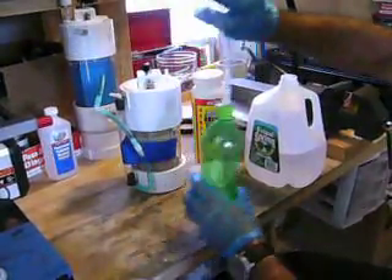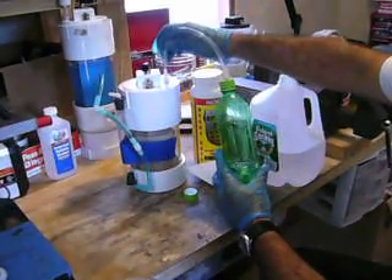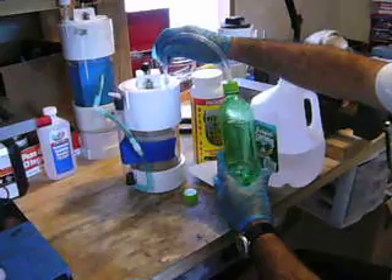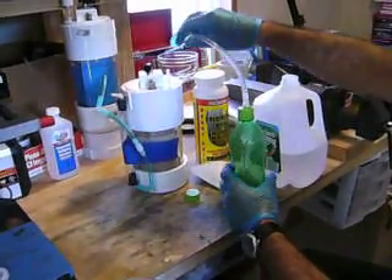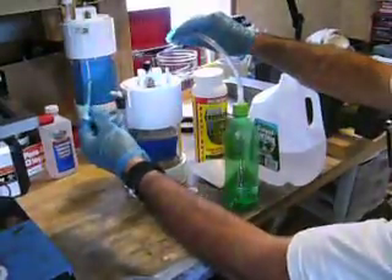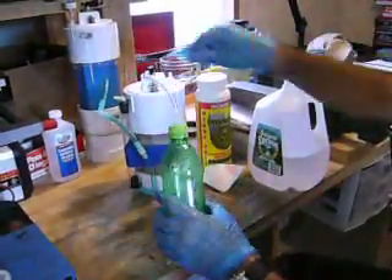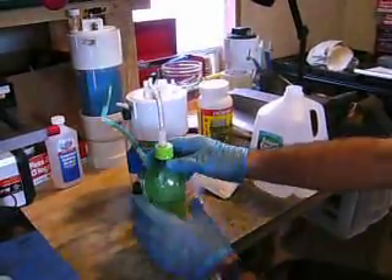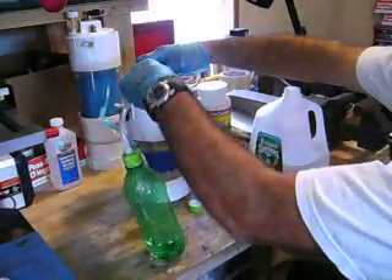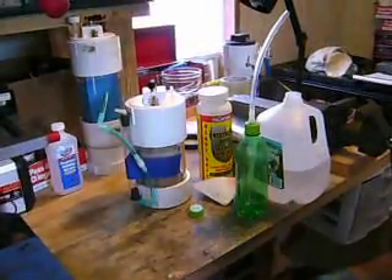You have two options to add to the cell. All my cells come with a refill port — you can add it there. Or if you've got a bunch of plumbing coming off of that, you just take the quick disconnect off the bubbler and connect your poly tube right in there, fill the cell, and dump the electrolyte right in. Then hook up your ammeter afterwards and check your current draw.